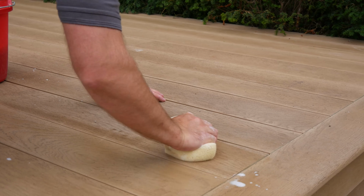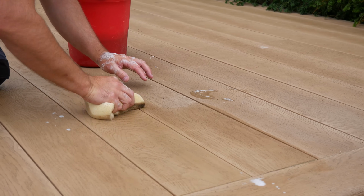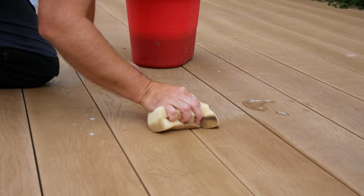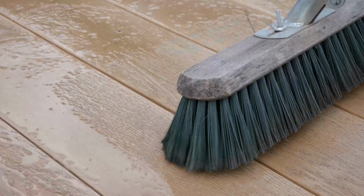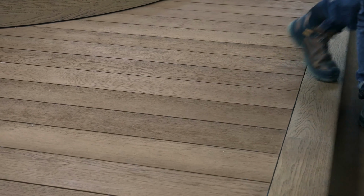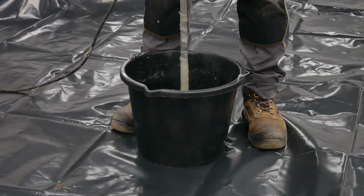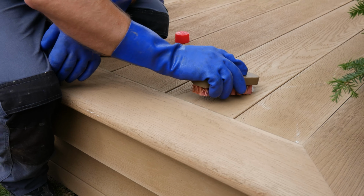If the board surface becomes dirty during installation, this should be cleaned as soon as possible using warm soapy water and a brush. Clean your decking when required to remove leaves and general dirt particles. Cover the boards from any surrounding building works or painting that could mark the surface of the boards. Stubborn marks may be removed with a range of different cleaners depending on the mark.